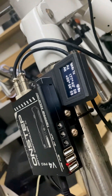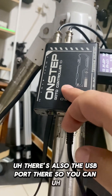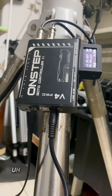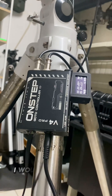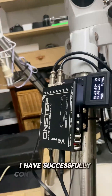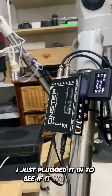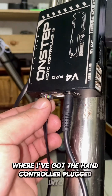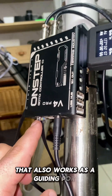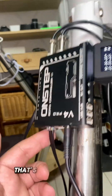The control box also works as a power box — you can plug in dual heaters and so on. There's a USB port so you can plug it into your computer and run it through ASCOM, though I haven't done that myself. I have successfully connected it to my ASIAIR box, though I just plugged it in to confirm it would connect and it did. The port where the hand controller is plugged in also works as a guiding port, so you can guide through an ST4 cable from your guide camera.